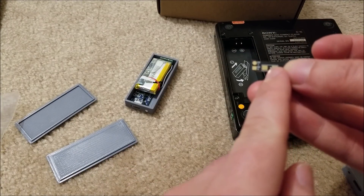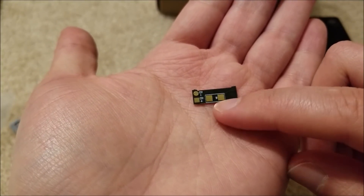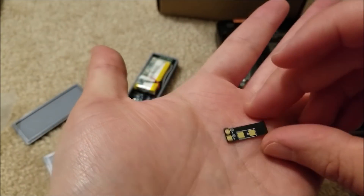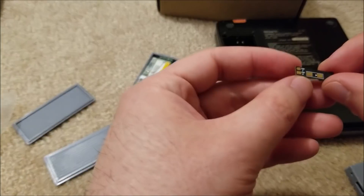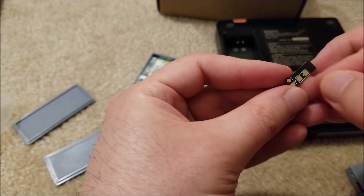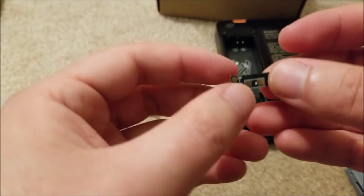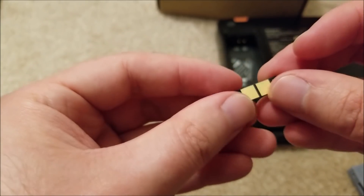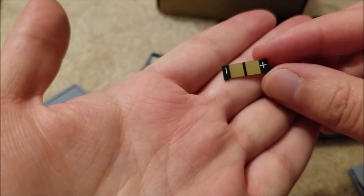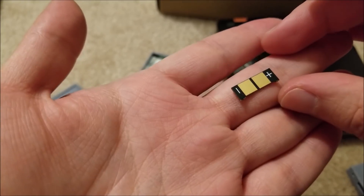The problem with the diode is there'll be a voltage drop, so I'd need a Schottky or germanium diode with a very low forward voltage. Alternatively, I included a trace to shunt it — if you want a diode you cut the trace and solder one in; if not, just leave the trace and never plug it in with the battery inserted. I'm probably going to predominantly use this as a battery-only unit and not leave it plugged into a wall.